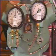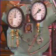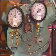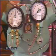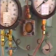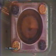The crankcase sight glass is solid foam. There's still some oil coming into the inlet, located at about the 10 o'clock position on the oil pump, so there's some flow through the shaft. The oil pressure will pulsate, getting up to that critical four or five pound level for an 06E — it's only a pound or so for a 06D. It looks like it's starting to recover, and the oil pressure does indeed build up. But the sump is still almost solid foam, so it'll lose its prime again. Still, there's marginally enough pressure to keep the oil safety switch set, and it won't produce a compressor failure.